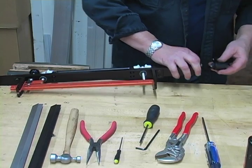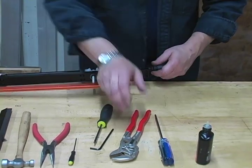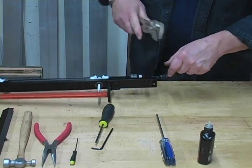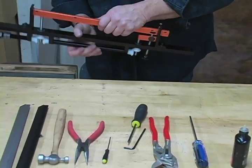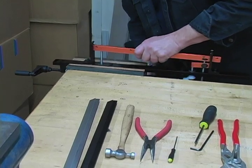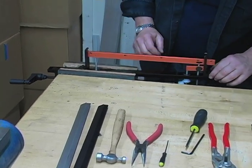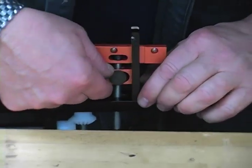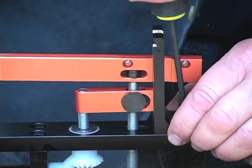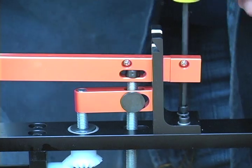At this point I like to do the rest of the work in my vice. Before I do that I'm going to put on the jam nut and temporarily attach the handle. I want my handle as close as I can get to the vice to minimize flexing of the keel. What I'm going to do right now — you'll notice this slides back and forth — I'm using my fingers to align this flush, then I'll go ahead and tighten this.